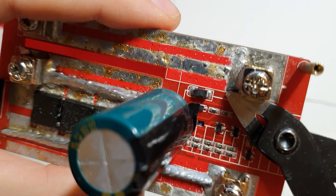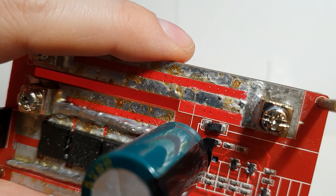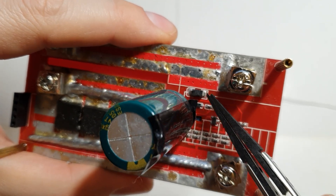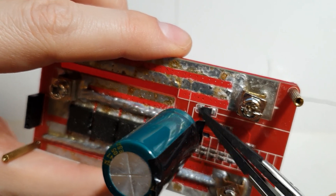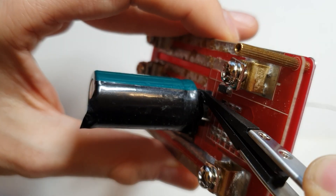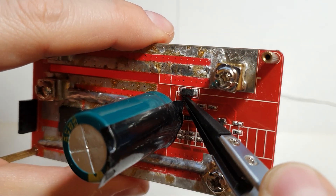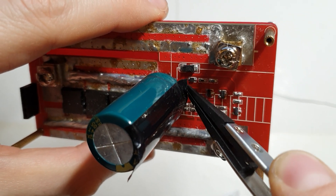What I did is flip the diode around 180 degrees. The orientation goes from positive — this is the positive contact, it is wired to this pad here. It goes from positive, this direction, to this track, and then to the positive side of this big cap, powering the rest of the driver circuit. The plus side of the cap is labeled here, and you need to free that left side, then solder a resistor in series.